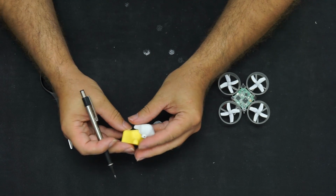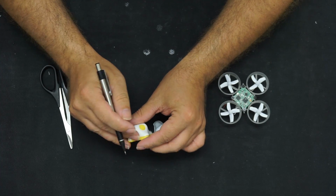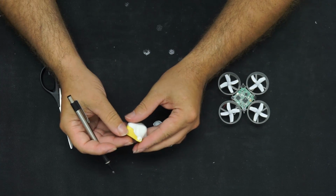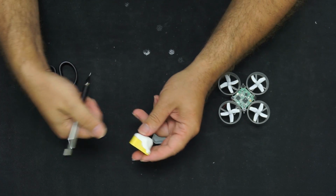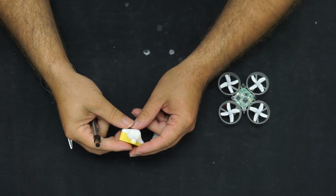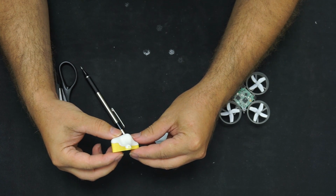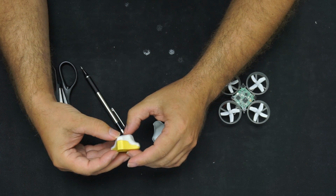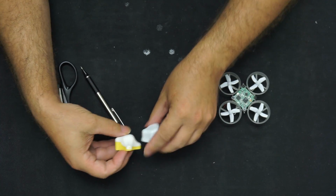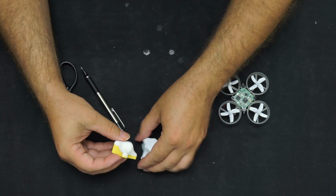But if you were to take and transfer these curves to that mold along that, you could actually, on the vacuum form, have that cut line predetermined, so you're going to be able to just take some scissors and you don't have to measure it out yourself. Now, the one that I've already cut on there, you can see the cut line as it goes around the hood all the way around. And that's all we need to do to that on the vacuum forming. So you just basically transfer these cut lines.